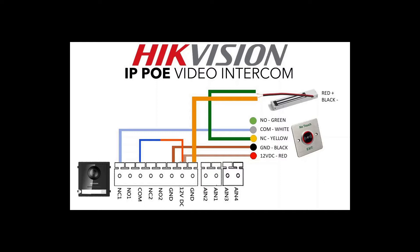So how have we got our setup here? This is our door station control panel at the back. From here we have six cables coming out. NC1 connects to the white common port. If you're not sure what these colors mean — the exit button comes with five cables at the back. We actually only need four of them to connect to our system. You just clip it in; it comes with the unit and is ready to be connected up. You'll see on our live demo coming up how that works.